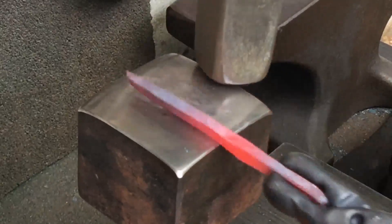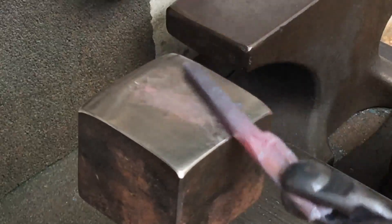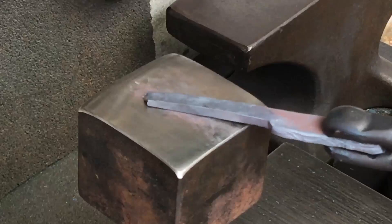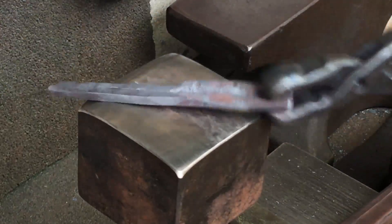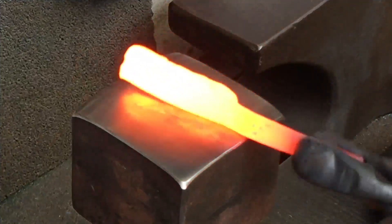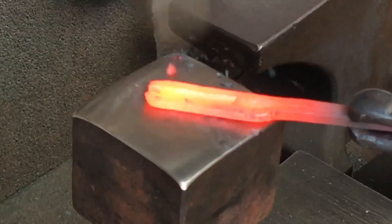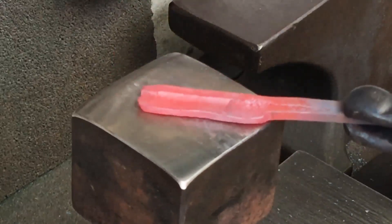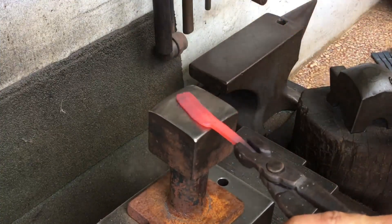For such a small anvil, I'm just really pleased right now. One of my big downfalls with making edge tools is I don't draw the edge down enough, and not having any sophisticated grinding or sharpening equipment, this is really important — or at least I've learned that. My hope is that this convex face will allow me to draw down edges much more easily.